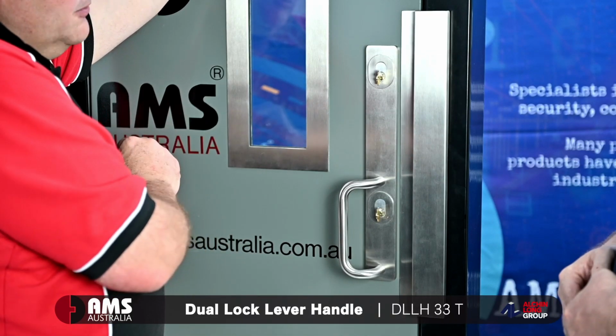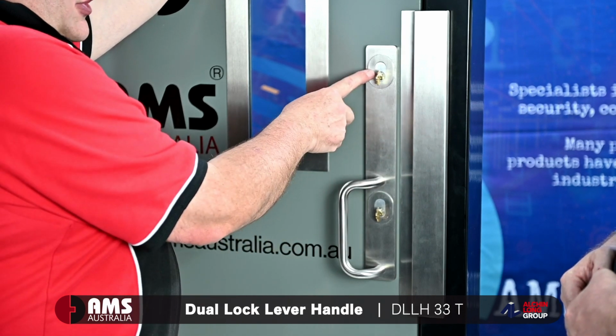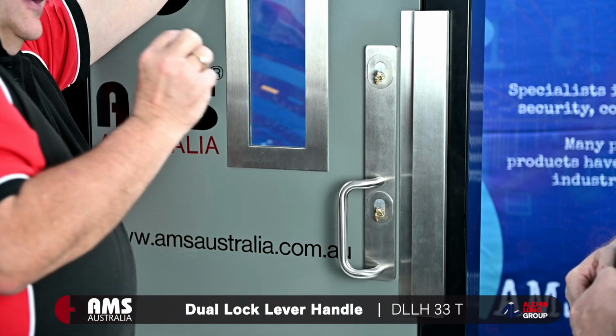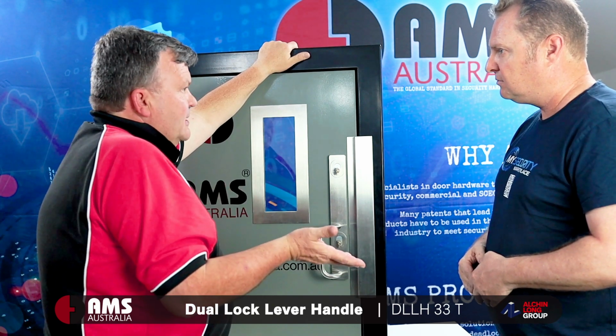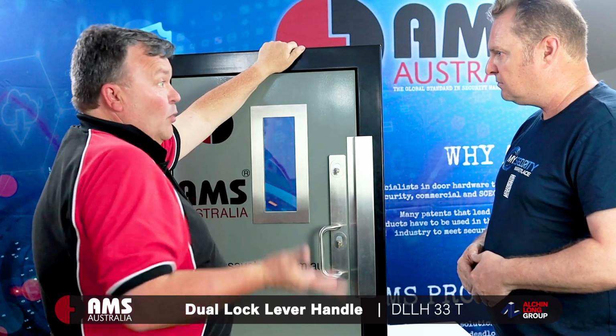So what we did there, I designed it in such a way that this top escutcheon here is adjustable. If the installer of the locks is slightly out with their installation, I'm only talking a few millimeters, but a few millimeters will make the difference of whether you can get the handle on or whether it won't fit.